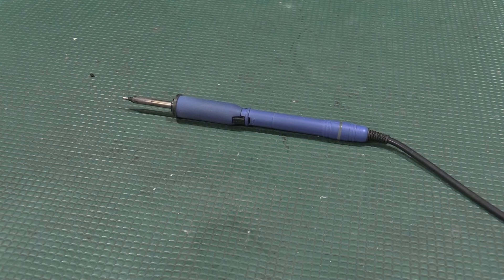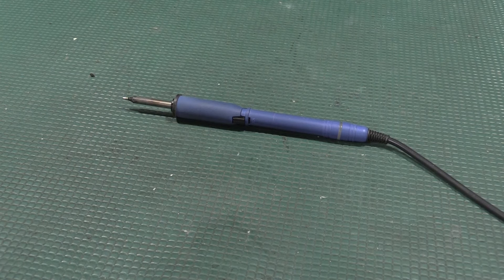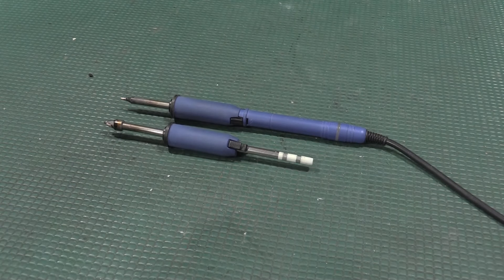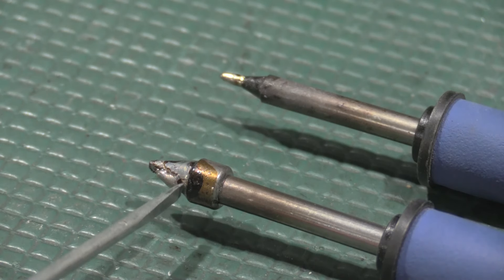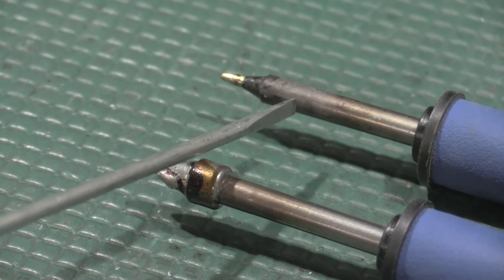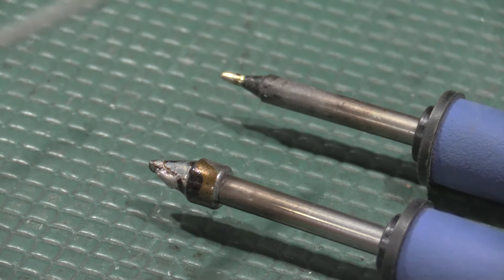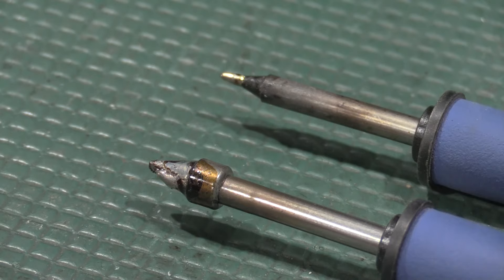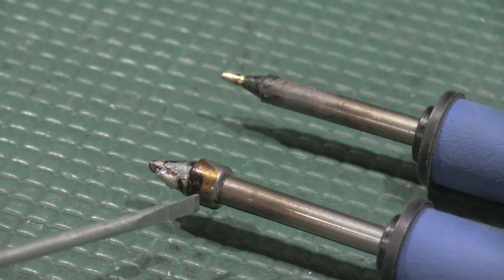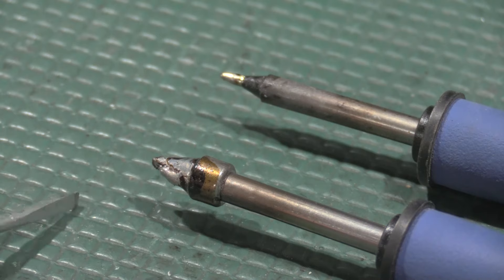The tip thermal mass is really important, and that's where different tips come in. For some of my heavier duty soldering jobs, I have a tip with a much larger thermal mass. The business end is where it's silver — this is tarnish here, I use this tip a little bit, but nowhere near as much as this one. You can tell from the tarnish that this tip has seen a lot of hours and is probably the most used tip in the lab for getting things done.